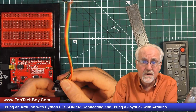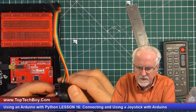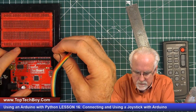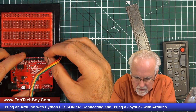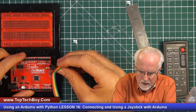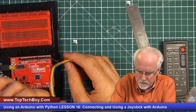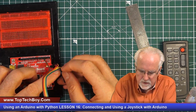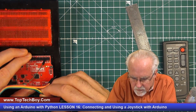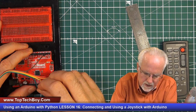Now you can use whatever colors you want, but you see this ribbon cable just makes it convenient. The brown, which was the first one on the left, we said was going to go to digital pin 2, so I will plug that into digital pin 2. Let me go in order. The next one was yellow, and yellow was Y, and Y was going to be A1. And then the next one, green, was the X, and that's going to go to A0.